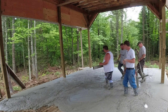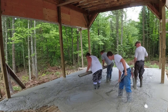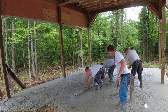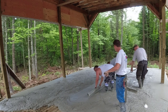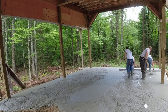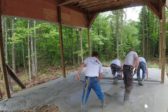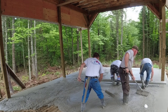I've got some other concrete screeding videos on my channel if you want to check them out. Although we're not using a power screed today because this slab actually has a crown to it — where they're striking the pads right now is higher than the outside edges. Sean wanted a little bit of a crown so if he ever gets any water in there, it'll tend to want to run out the edges. But we also have power gas-powered screeds and battery operated screeds. Today we're just going to screed old school — we call this kick screeding.